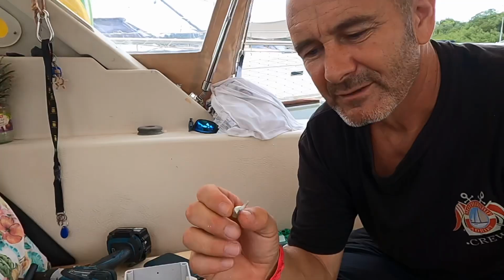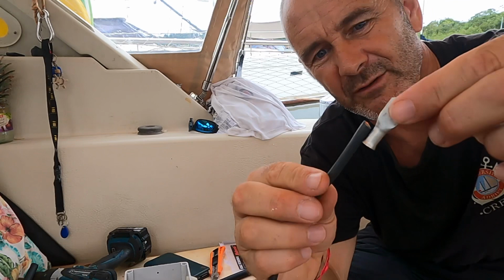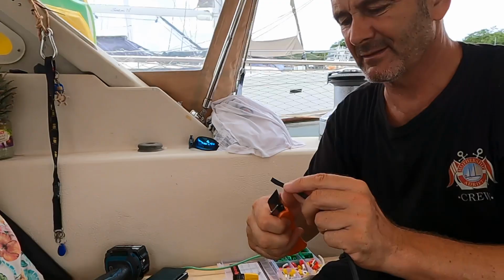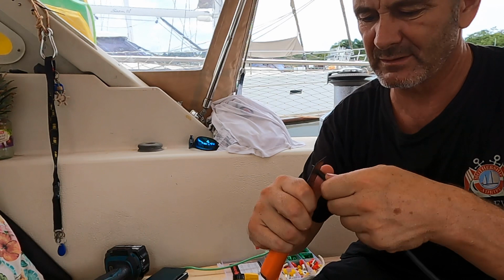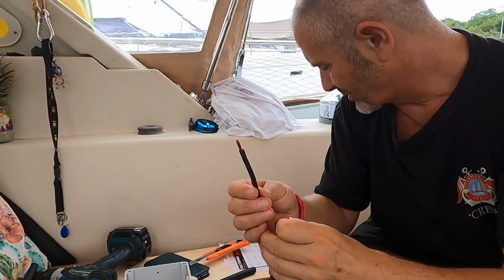So it's always difficult jumping between American standards and European standards, or metric and imperial. But I've got these lugs, and so these will be fitting on there like so. Just going to cut that around very gently onto the copper, so I don't cut any of the copper strands. Pull the insulation off, use a bit of force to get them off.